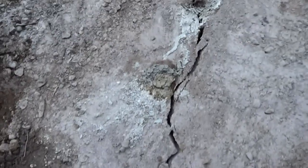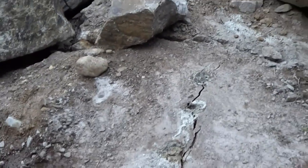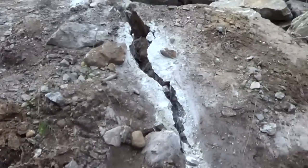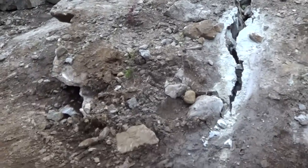All right, this is great news. I have been vindicated — my wife said this EcoBust stuff would never work, but it did. I missed one little note in the directions: it said you need to let it set up for twenty-four hours, yet it will continue to expand for up to seventy-two hours. After twenty-four hours I came up here and nothing happened. But now at forty-eight hours, we can see a nice crack right through here. All four rocks that I drilled actually cracked. I got so excited I came up here with the excavator and pulled them apart, just to make sure it really did work.